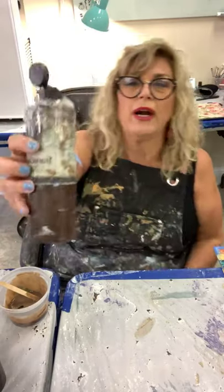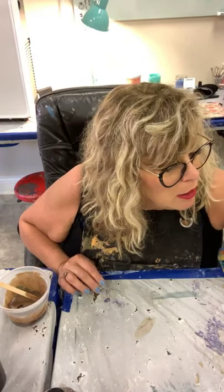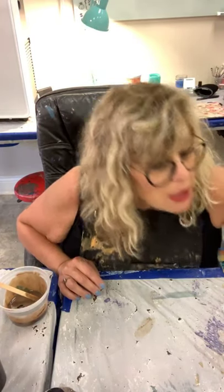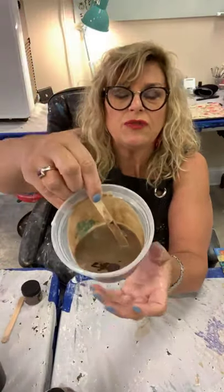I think I'm gonna add a little transoxide plain brown from Faux Effects. And then, just to jazz things up, I'm going to add, that's the wrong one, our primary elements, cinnamon brown, which is a very, very red brown. It doesn't look like that in there. But once these pigments hit liquid, their color blooms. And I've used about an eighth of a teaspoon in there because I'm just changing the color. And if you look in there, you can see the pigment sort of floating on top.